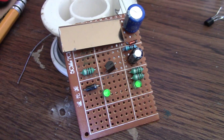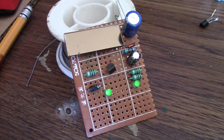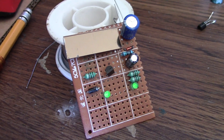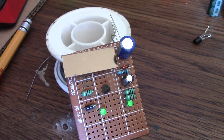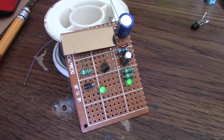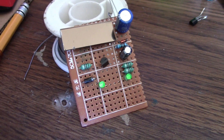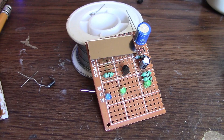Just to say, I'm only running directly from the solar - there's no storage capacitor. That one at the top right is a 1F 2.7 volt supercap, but as you can see by the legs hanging out at the back, it's not in the circuit yet. I just wanted to see what would happen when it was running only on solar.